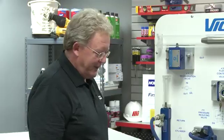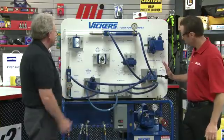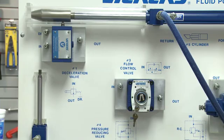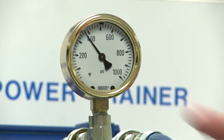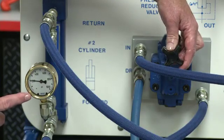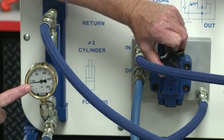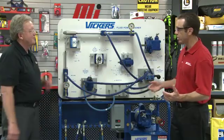We can fire it up. Now shift your valve. We've got both of those going out now — they're fully extended. Both cylinders have deadheaded. Take a look at the high pressure — still at 400. So by adjusting the pressure-reducing valve, I will be able to change the pressure on this gauge to a lower pressure. I'll adjust it to 200 PSI, and there we have it. We're good to go.